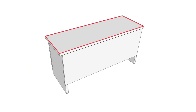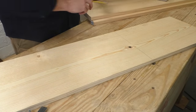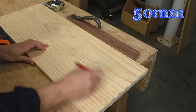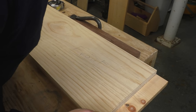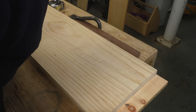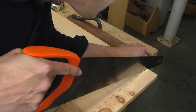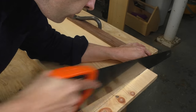Give it at least a week to acclimate to your shop, and then we can start cutting. The top is the longest part and it determines the size of everything else, so think carefully and leave it a little long just in case. The front and back are two inches shorter than the lid, and you want clear, straight timber, especially for the front. Cross-cut carefully and stay close to your lines to minimize trimming later. I'm using my saw at a shallow angle to track the line and blowing away the dust to keep everything visible as I work.